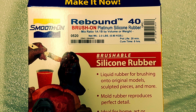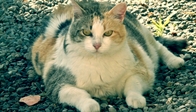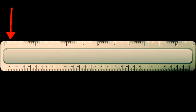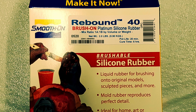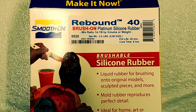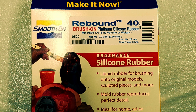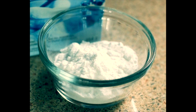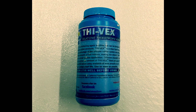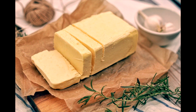We should build this mold in at least 4 layers thick, ending in an overall total thickness of at least 3/8 of an inch. The first two layers of silicone will be the detail layers — just adding silicone by itself with no additives. The last two layers will include a thickening agent such as fumed silica, or in this case Thivex, to thicken it to a creamy peanut butter consistency so we can butter it on and create a reinforcement coat.